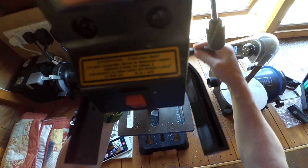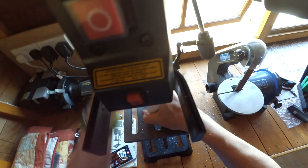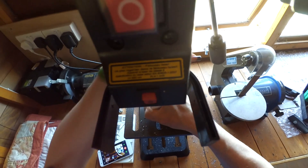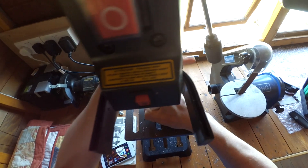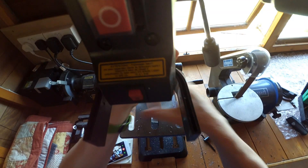It's a bit cumbersome — I'm having to raise the drill press bed in order to keep up with the tap as it advances into the part. It's not ideal but it's adequate. For the larger hole I took the jig over to a vise and finished the tapping operation there with a hand tap, after having established the perpendicular hole.